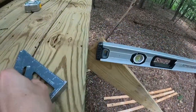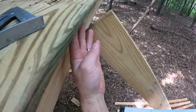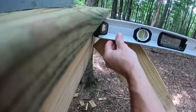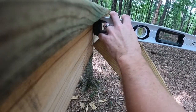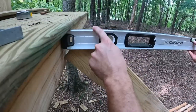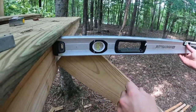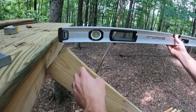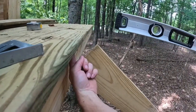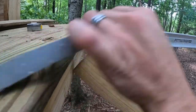So here's what we're going to do. I'm going to have it sitting up underneath this decking — it runs all the way up. So what I did first is I put this up here, got my level line out here, and got this point up here. I got that to sit level with it. Once you've done that, you want to sit it on top, because now this point right here is at the bottom of that board, because I have it level.